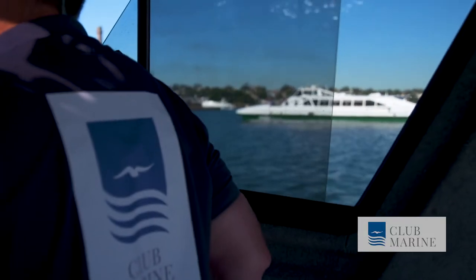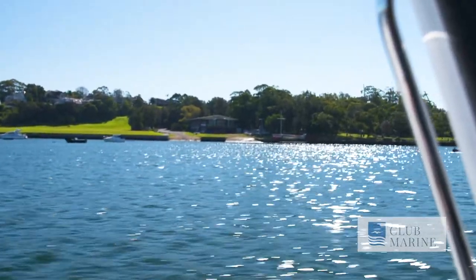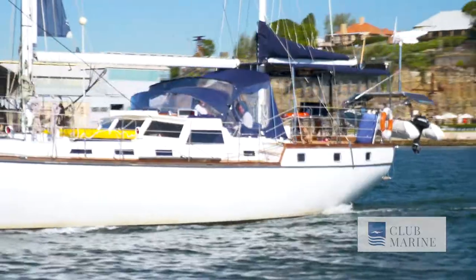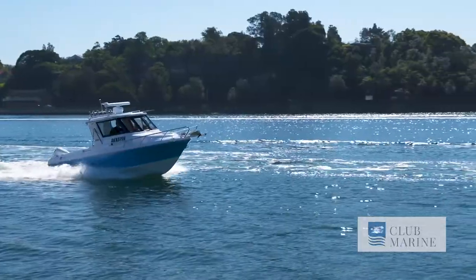They reckon a boat is a hole in the water that you keep sinking your money into. Well, this could be true, and if you get a hole in that hole, well, it will sink straight to the bottom. It takes only one faulty hull fitting for your pride and joy to go down the gurgler, or a leaky hatch. Boats can sink scarily fast. Seawater weighs over a kilogram per litre and it fills voids that normally provide reserve buoyancy. Even a frightened bloke with a bucket can't keep up.